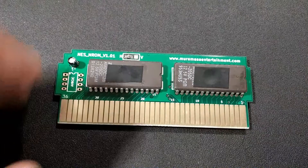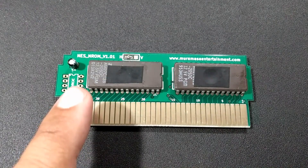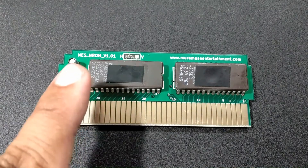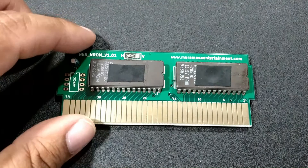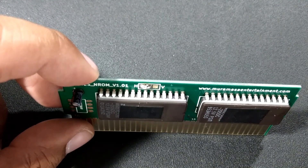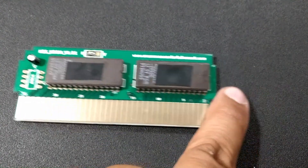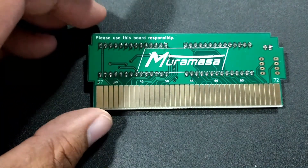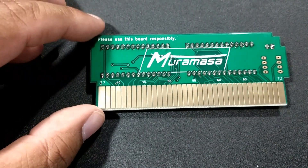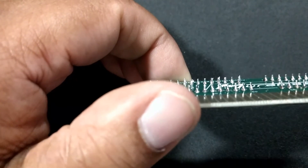The repro Space Invaders is complete. PRG on the right side, CHR on the left side. No security chip, since I'm playing this on the clone console. The capacitor is placed. And the mirroring — remember, we said horizontal — we made sure that we put solder between the first and second pins to make contact and create a bridge between both. Very important. Remember the notches — the chip notch goes on the right, same for both chips. You can see my soldering skills, which are not great, but no contacts are touching each other, which is good, and each one had a good amount of solder.